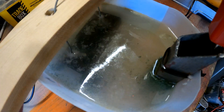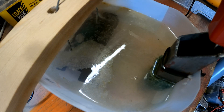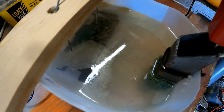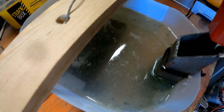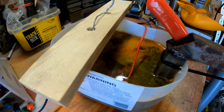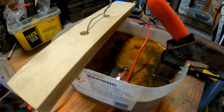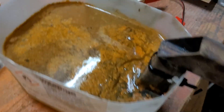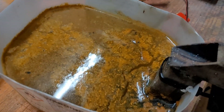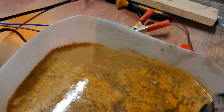During this time-lapse you can see how the material coming off the part we're trying to clean heads towards the anode — this sacrificial bit of steel will rust up and you won't be able to use it again. At this point I've changed the sacrificial anode because I needed a slightly bigger piece, and I've also connected the negative power directly to the part rather than the hanging wire. That's what the water looks like at the end of it — that anode will be fairly knackered now, nice and mucky.